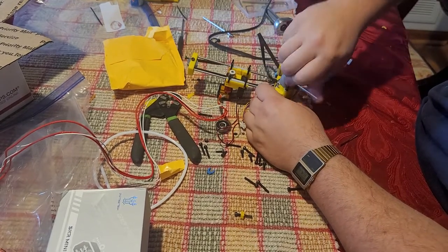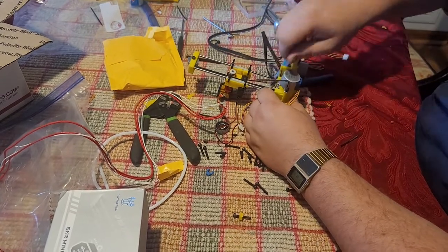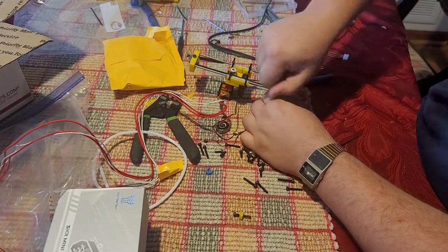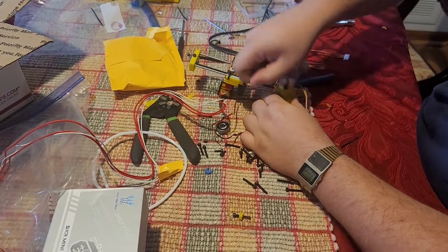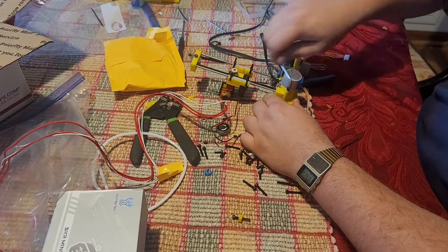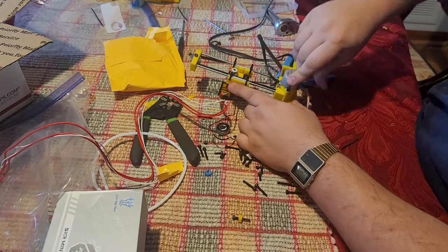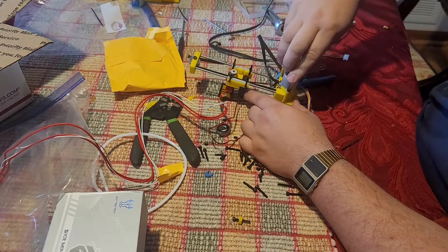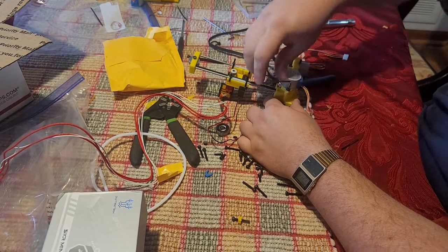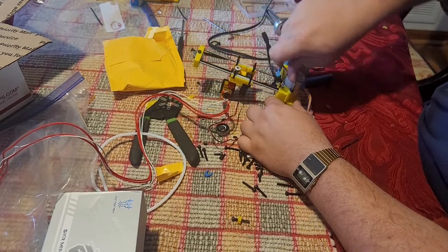And note there are some extraneous holes in some of these parts from earlier iterations. Like the X slider here has a hole down there that was used for an end stop switch back before we went to sensorless end stop homing. And the earlier versions from 9.4 and back had a fan on the side here instead of a fan in the back. And that's where the hot end fan was mounted. But it was very easy for people to get confused as to how that mounted, and this way actually cools better. So we did it that way.